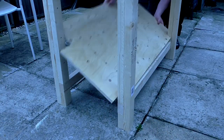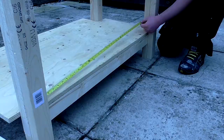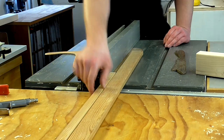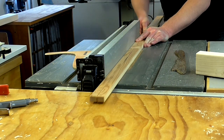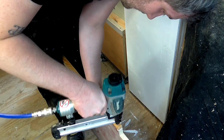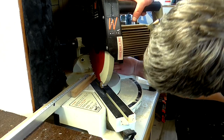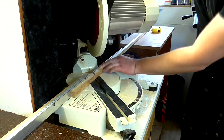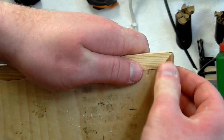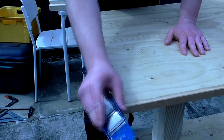And that fitted in place just fine. We wanted to cover the plywood edges at the front of the workbench to make them more hard wearing. I had some reclaimed pine bed slats which I ripped to strips of 20mm on the table saw. Then I glued and brad nailed it to the front of the shelf, making sure that the trim was flush with the top face of the shelf. For the worktop we did the same again, except we also mitered the corners and did the sides of the worktop as well, just because they would be more visible and this would give it a cleaner look. I used a block plane just to break the sharp edges of the trim pieces.